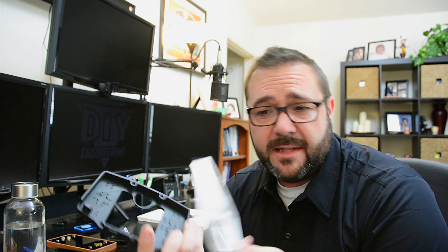Now that we've got the bodies all 3D printed, they turned out great. We've got standoffs for all the circuit boards, the surface finish is great, and we've got sockets for the components as mentioned in the design, which will allow for easy assembly and minimal need for any circuit boards. The next step is to prepare the controls — they'll be milled out on the Nomad 883. We'll gang them all up so it's easier to mill out of the Delrin plastic. Let's hop over into Fusion 360, generate toolpaths, and get these things milled.